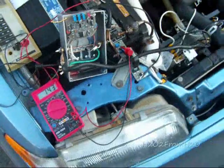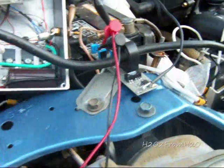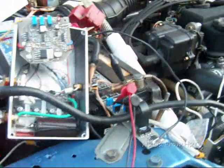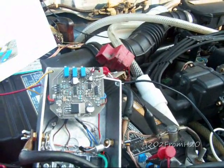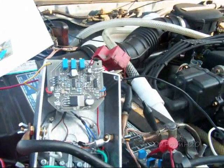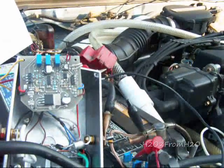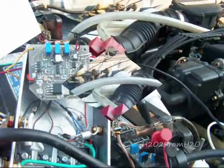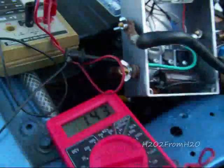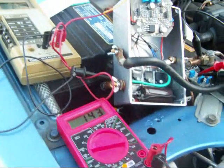The PWM is actually functioning. So the first step — you've probably got your cell already mixed up. You need to know what your peak current is. You should set your peak current when it's cold; we want to know what peak current is. Currently we're at 14.3 amps.